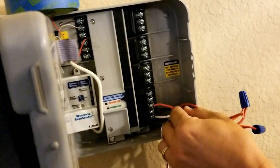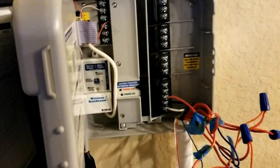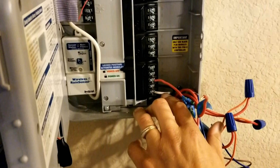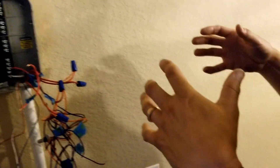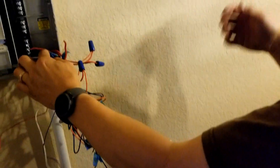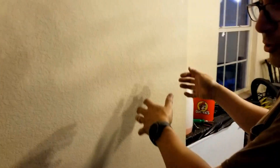There's instructions in the plastic box. We've got all the wires here, pretty much loosened and disconnected and not connected anymore. We were trying to figure out what PMV meant. Right there — you got your common which goes to every valve, and you got your PMV which is a master valve. Since you don't have what's called a double-check valve, this prevents water from flowing back into the water supply. This valve stays closed until something turns on and opens it. I think it's a minimum of 10 feet from the house or the main water supply.